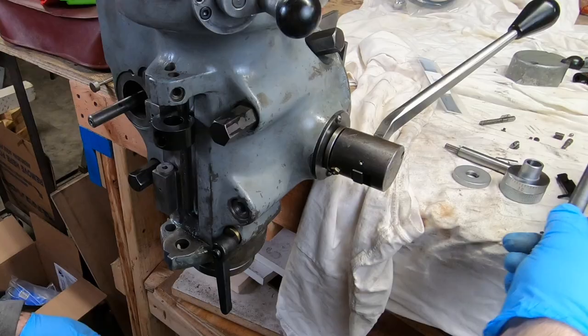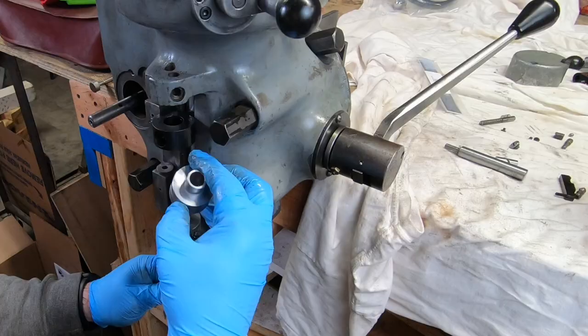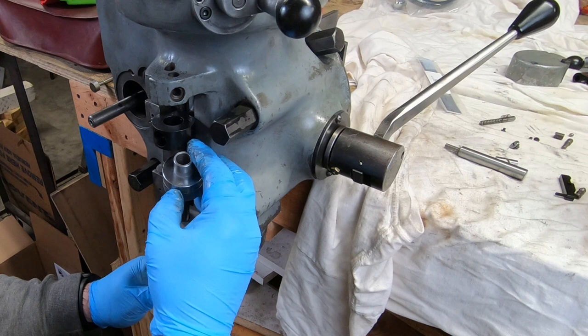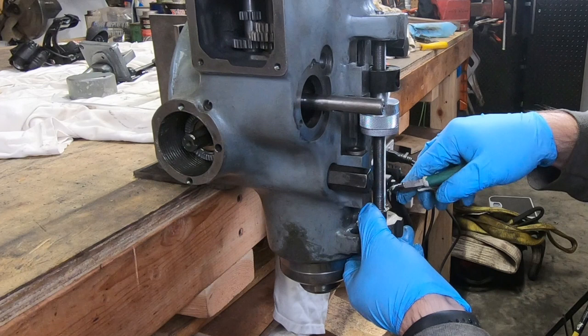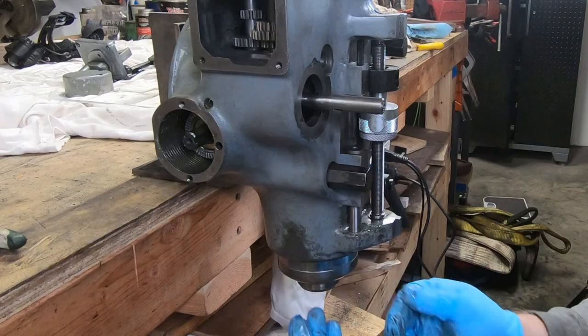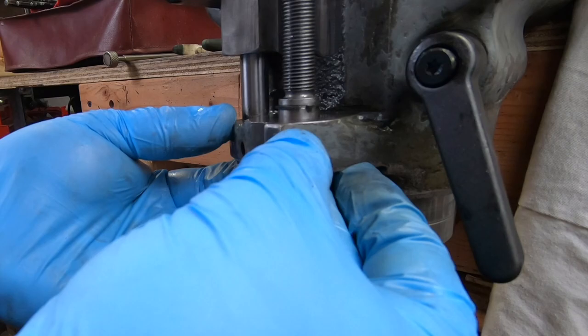Next I am installing the micrometer screw. First goes on a snap ring and then a jam nut, and after that a quick nut — this has a little button on the side that allows you to move it up and down on the screw very quickly. Once I have it in place I will secure the snap ring into the groove near the bottom of the screw. After I insert the feed trip plunger, making sure it is moving freely.